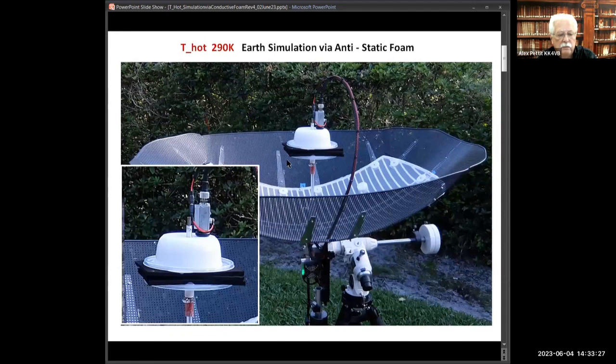I did this four times, and this is the result of refining the process of being able to add absorber samples, sandwiching them in directly under the feed. This one has a polyethylene lid between the loop feed and the absorbers. That wasn't there before. There was always the possibility that the absorber may have actually been touching the loop feed. These final answers differ by a few fractions of a dB, and so that may have been the issue.